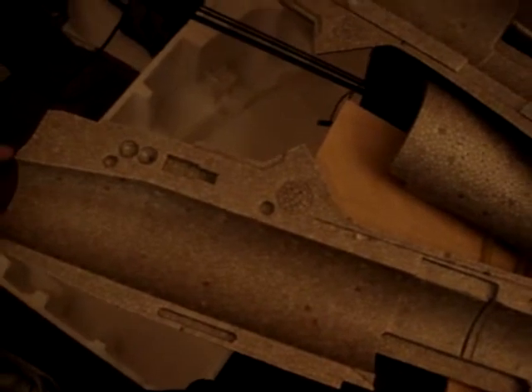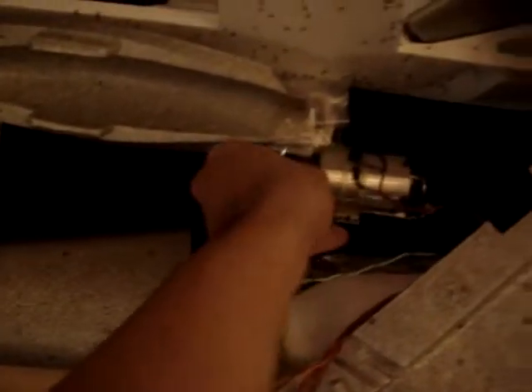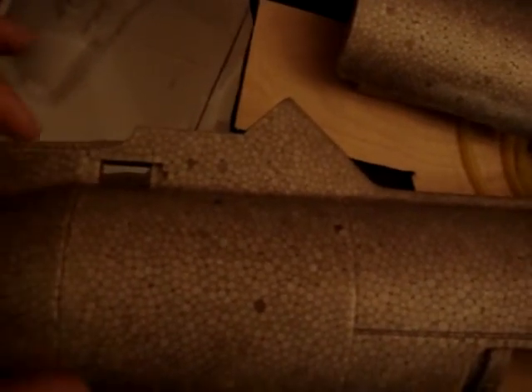You can see the fuselage main parts, and it gets tighter toward the rear. We will probably cut off the part where it gets tighter and put the turbine right here — it's quite nicely spaced for the turbine. However, there is also a place for the elevator servo, and if we cut too much out here, the servo will have no grip or hold to be stable there.